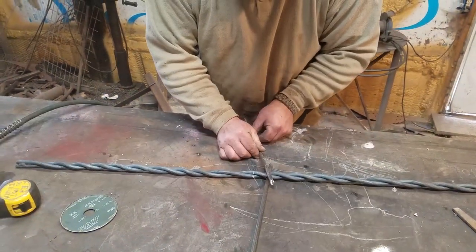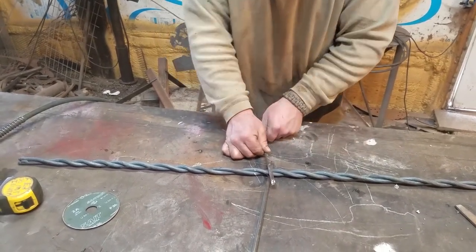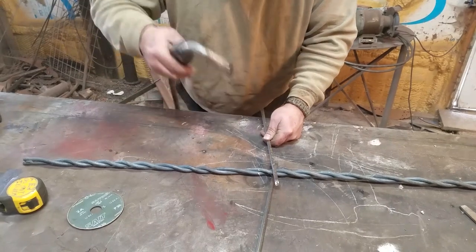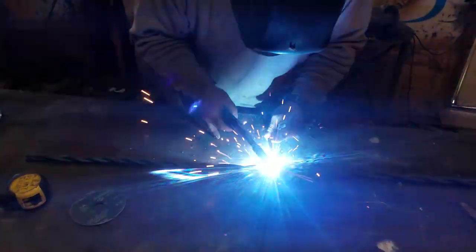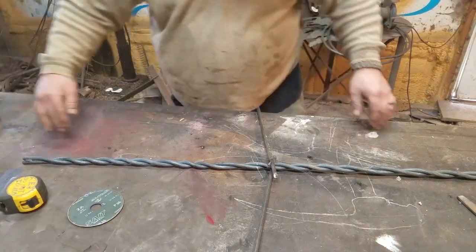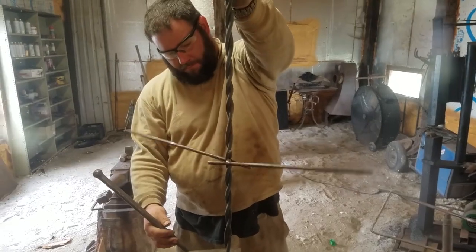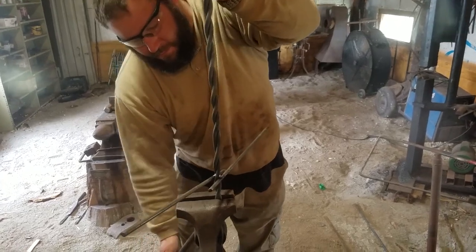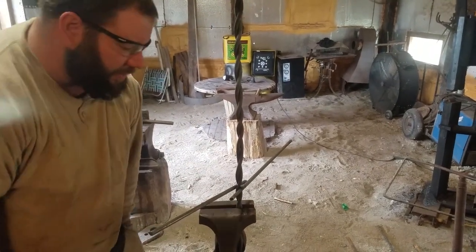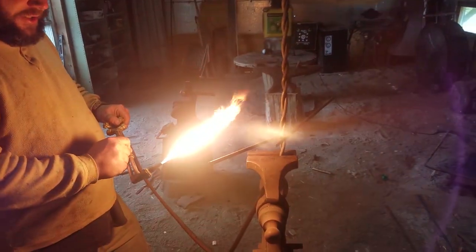Flip it here. Make sure your barb is the same way so it looks right. Pick it up off the table a little bit — you want these two to be parallel. Now we've got them both tacked on there fairly well. We're going to take it back to the vise, get the torch, and we're going to wrap them. See those ugly little welds there? We're going to wrap this other 3/8 rod around here and cover that up. It'll make a really cool looking barb — just like a big giant piece of barbed wire.